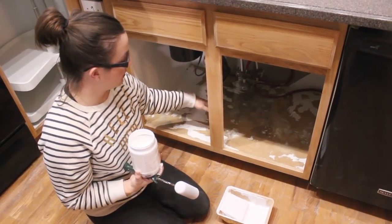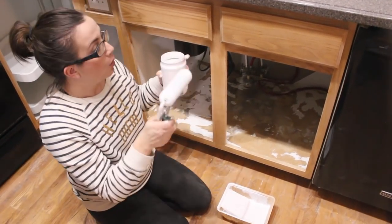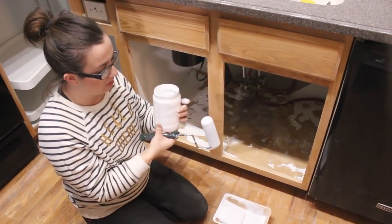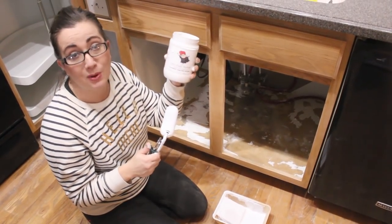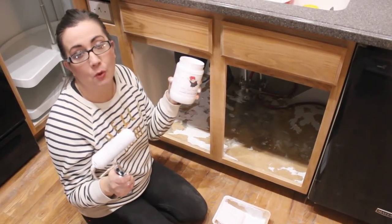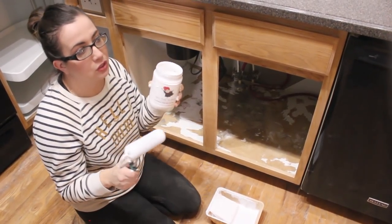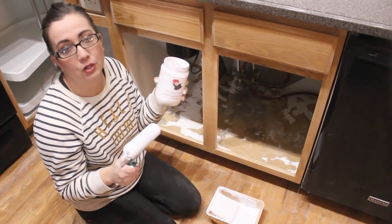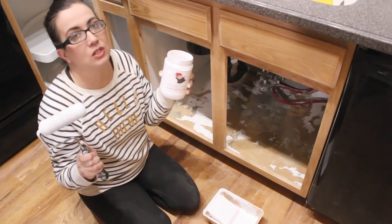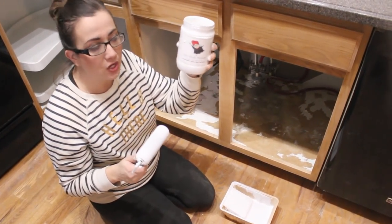Please ignore this — we have water damage, we cleaned it out, we're going to put a new bottom on there, but we're already to the priming part. We cleaned the cabinets, we sanded them, so the very next step after removing all the sanding dust is to prime. We're using Fairy Chalk Mother High Bond Primer. Technically with DIY paints or other good chalk and clay paints you don't have to prime, but these are kitchen cabinets and they get a ton of use. So we're pulling out all the tricks, doing everything we can to make them as durable as possible. That's why, even though you don't normally have to sand a lot with chalk paints, we did anyway. We scrubbed them with TSP, we sanded them, and now we're using High Bond Primer by Fairy Chalk Mother.